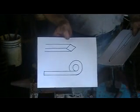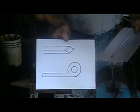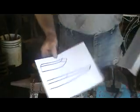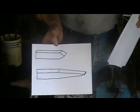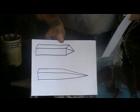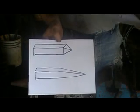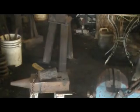This is a one-sided taper, and you would use it to make a hinge or a chisel. And again, you're only limited by your own imagination. The second taper is a 2-sided taper, either short or long. Again, you can make pickets on a fence or a chisel out of it as well. And the third type is a 4-sided chisel taper. All these you can use for anything from scrolls to making tools, so they all come out to be very useful and efficient things.